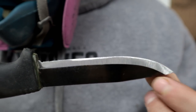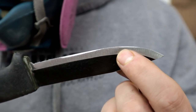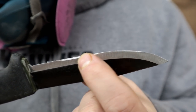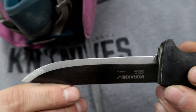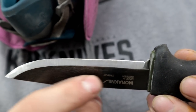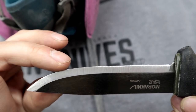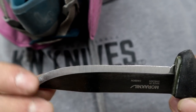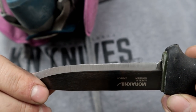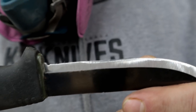This is what happens when you get on your whetstones and you've established uneven curves, and right here, it's almost impossible to get a good edge on your whetstone. I've done a little bit more work on this side so far, but you can still see a few spots right there. Even though it's a nice flat grind, there are parts where we've formed a burr and even gone past where we have a burr lapping over. There are spots that just aren't touching because of such a strong recurve.